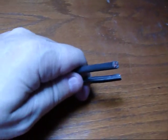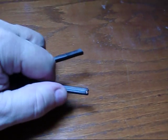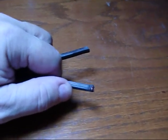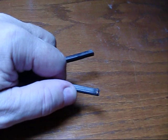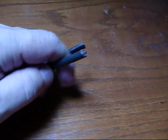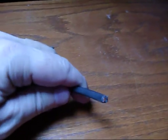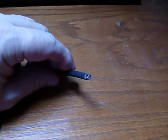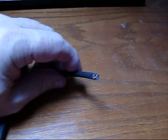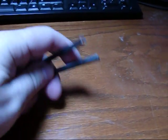Let me first talk about wire a little bit. If you go with real solar wire, the stuff that comes off the panel, it's called UL 4703, and it's 10 gauge wire, and you can buy that. It's about 80 cents a foot, but it's very good. It's meant for outdoor conditions in the sunlight. It's not flammable, and it's meant for higher voltage.